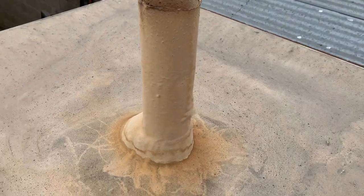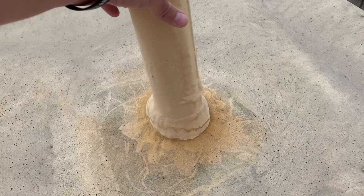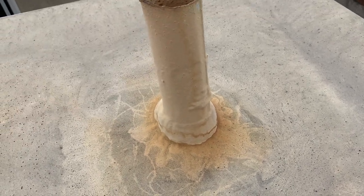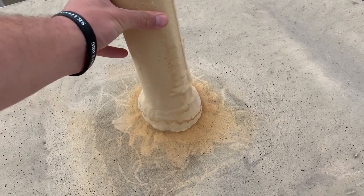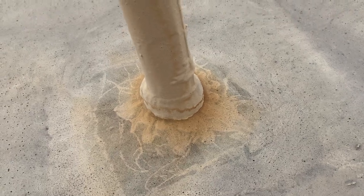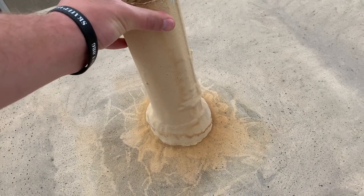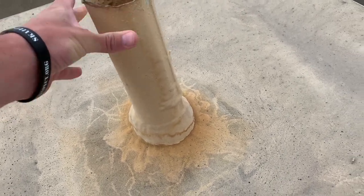You can see that penetration is not only holding up well, but it's allowing for plenty of dissimilar movement because this is the vent from a water heater, so it's heating and cooling at different paces than all of this. And that's important. The crushed walnut allows for greater elongation. You can see that's in there pretty darn well — and that was just a loose vent before the ecodor went on.